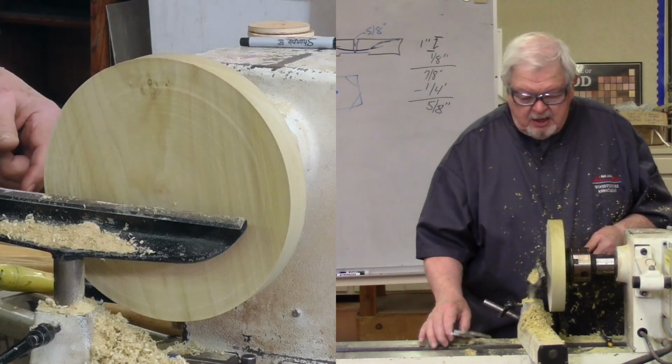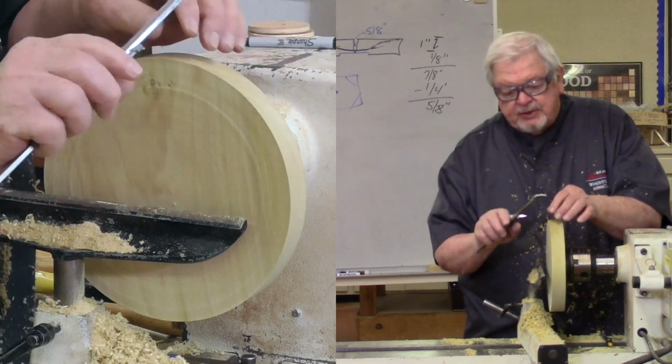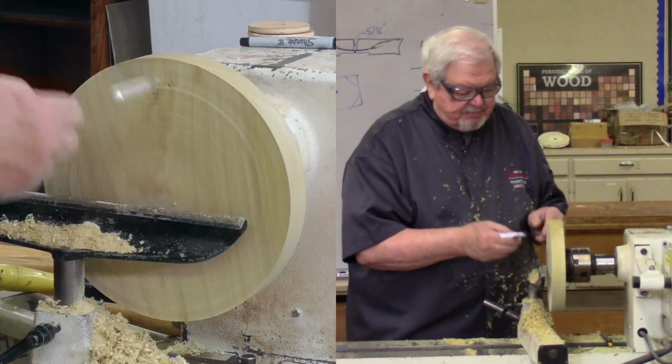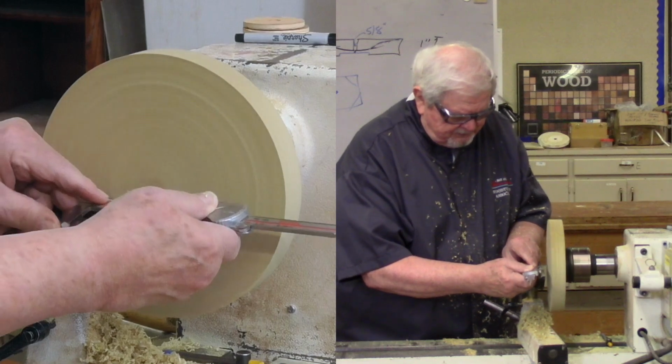into. Before I mounted this, I took a measurement of the outside diameter of these jaws. That's what's going to expand into it. I have transferred it to these calipers and locked it. So what I now need to do is put that mark here on the blank itself. I'm not going to touch both pieces, both wings. I'm going to touch one.